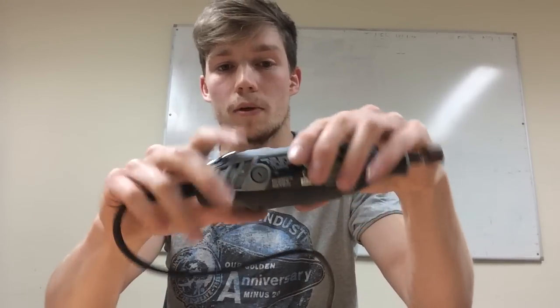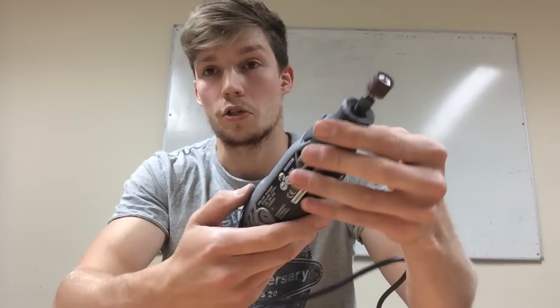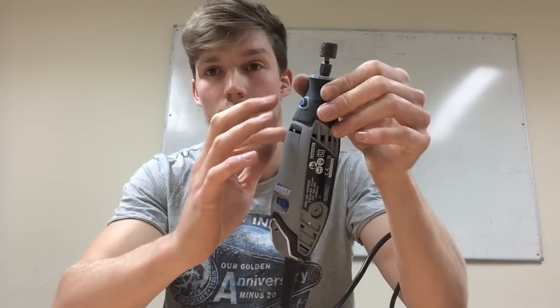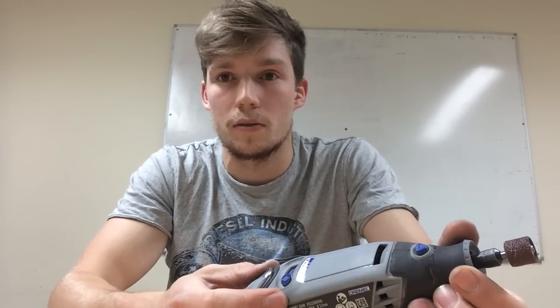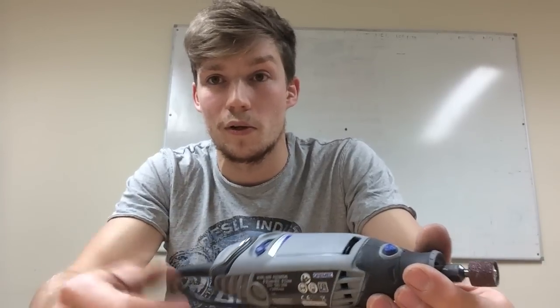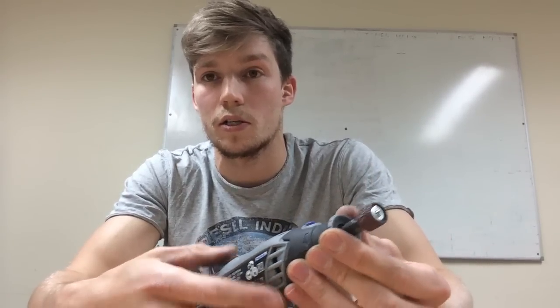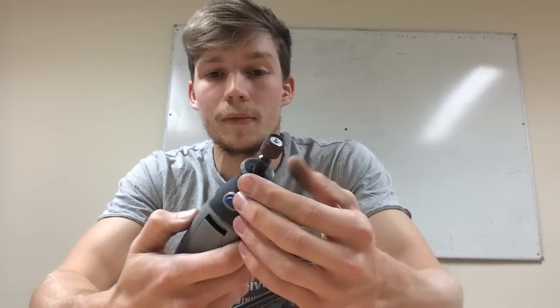You can also use it more like a pencil, as long as you keep the blow holes clear because it's an air-cooled motor. I've opened one up and it's pretty simple inside — just a few bearings and a big spindle. Because it's so small with a plastic casing it stays insulated, so you need to make sure those holes are open all the time so it can cool down. It does have an overheat safety protection, just like a hairdryer — if you use it too long it turns off and you leave it an hour or two and it'll start working again.